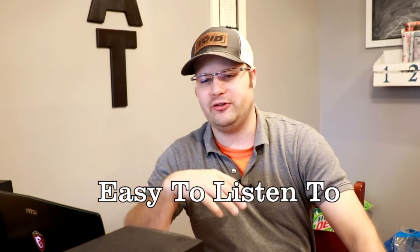The second goal I had is I wanted this to be a speaker that could be easy to listen to. Some speakers get fatiguing to listen to after a while, or something will come out and really hurt your ears. That's because there's a certain frequency range — typically between 1K to 5K — that our ears are very sensitive to. Now, what some people will do is EQ that part down. What I decided to do is take care of that in the crossover itself, so I wanted between 1 and 5K to be just a little bit softer than the rest of it.